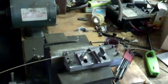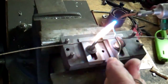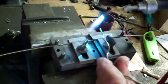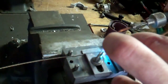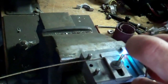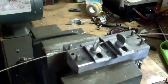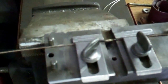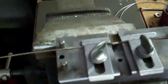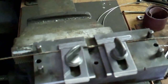With everything set up, I'm going to go ahead and give this a shot. Sometimes I preheat the brazing material a little bit and get ready, because this actually goes fast. That's done — it went that quickly. I know I got good flow and it's a strong joint. Doing this on camera I've got a little too much material on the joint itself, but I'll clean that up with a file until it's the same thickness as the blade.